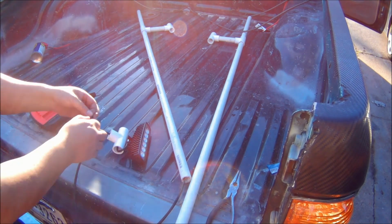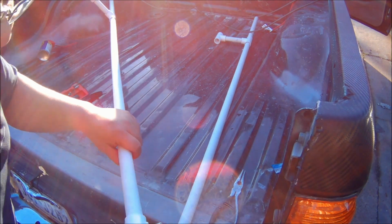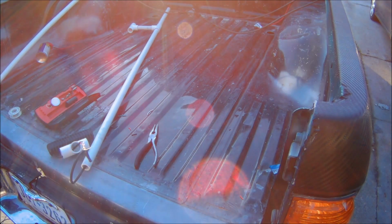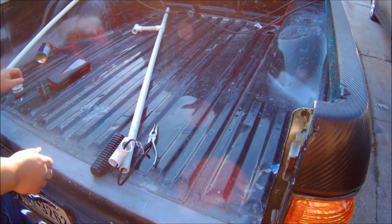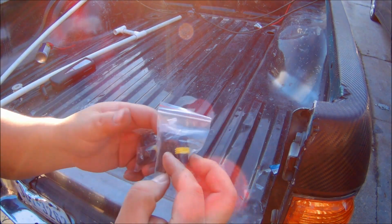You want to wrap these wires pretty tight because these wires will be underwater. So I usually wrap each wire, and then once those are wrapped, I will wrap the entire wire over again. And I find that the 3M tape just seems to hold up better underwater too. It doesn't seem to come apart as easily as the other tapes.